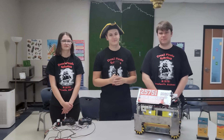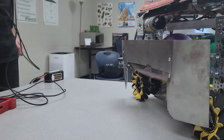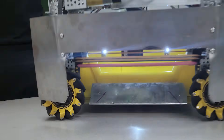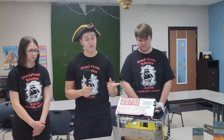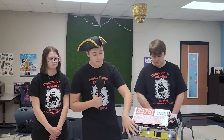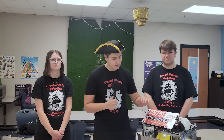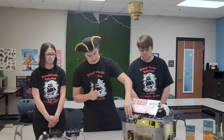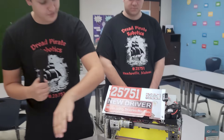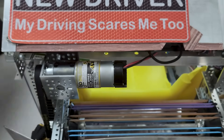Can you explain a little bit about your rubber band intake and how you've iterated on that throughout the season? Our first iteration was literally a piece of cardboard with some rubber bands attached to a drill. From there we put it into CAD, 3D printed it, and it's worked pretty well ever since. We've only broken it one time in competition. The motor is geared one-to-one, it spins the axle, and you drive up to get an artifact and just intake it.